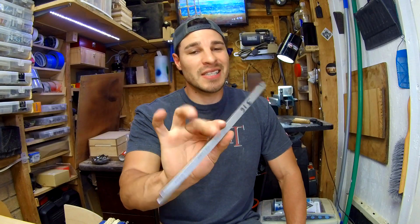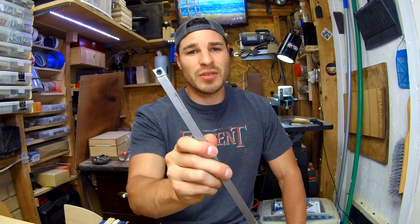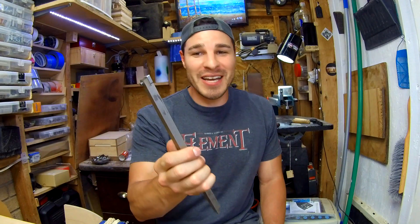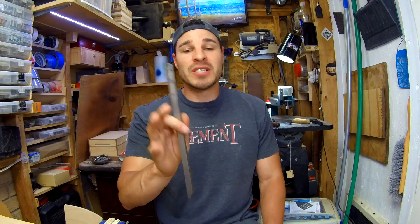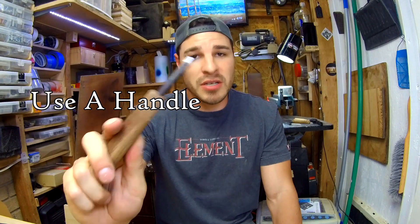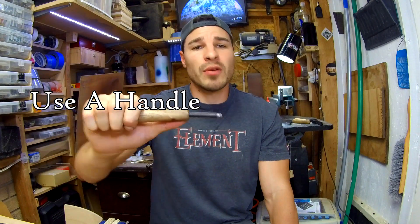Got it done in 316 stainless — I would have had a hard time otherwise and probably wouldn't have been able to complete the project. As you can see I've got a carbide insert in here; this is going to be used for the wood lathe and I'm going to be turning some stuff with this. My hole is a little bit off-center because I didn't punch the center, so I'm going to have to do a little grinding to make up for my inexperience in metalwork, but I got a hole tapped in it. A couple of tips: for the tap handle, as you can see it's just a piece of bar stock — I ground down the end so it fits snugly in my chuck and I can use this to twist all the way around and really feel the tap.